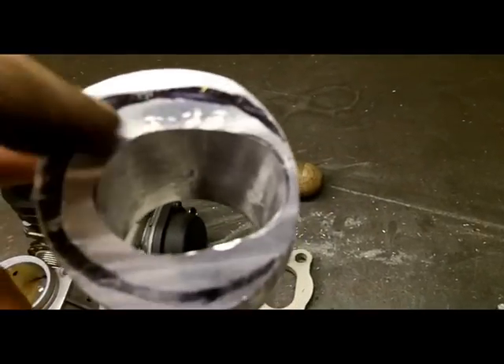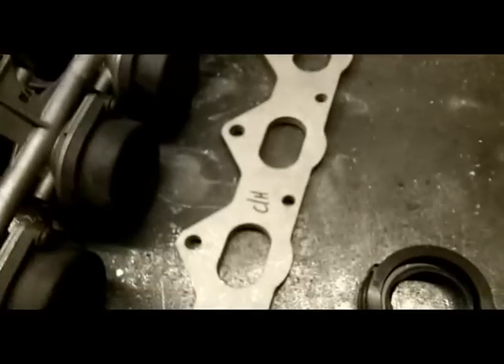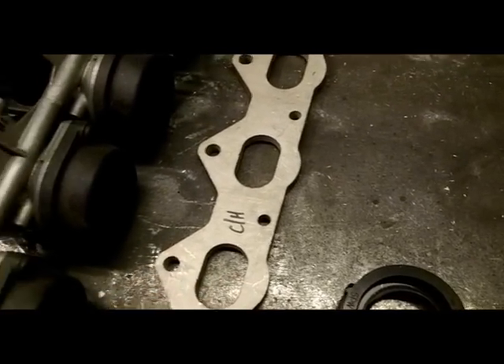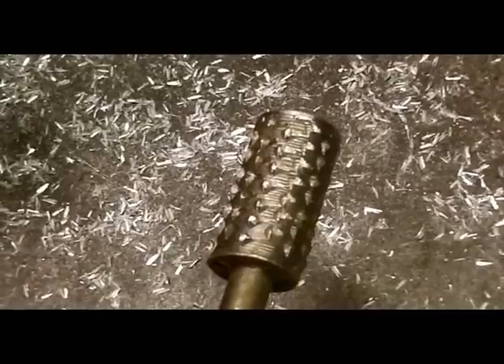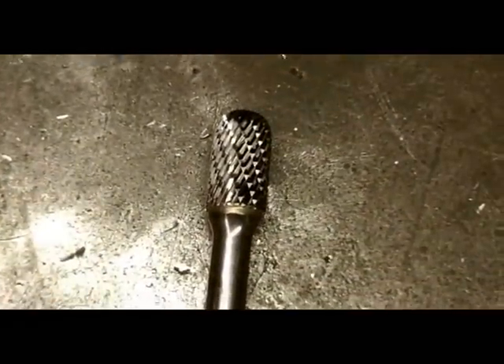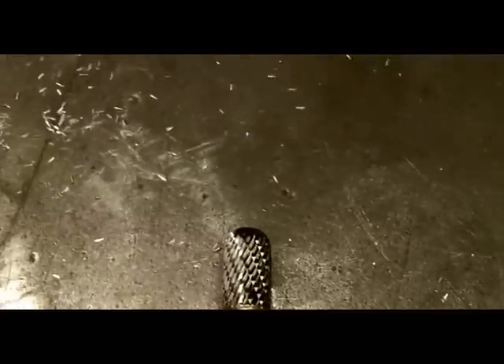So don't bother correcting me later on. The reason it's still slightly oval here is when they actually go into the manifold, I'm going to take a small taper out of the edge here, just to help the flow. These are the burrs I'm using - this one I'm using for really roughing out. I keep needing to stop and wire brush all of these because the aluminium clogs them, and then I'm using one of these to smooth out the taper.